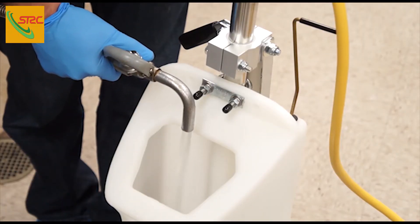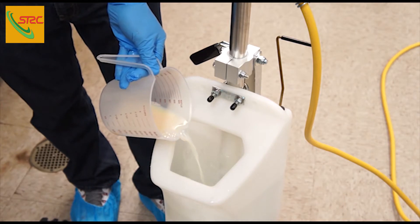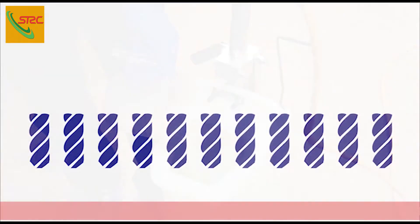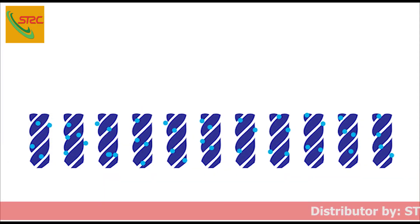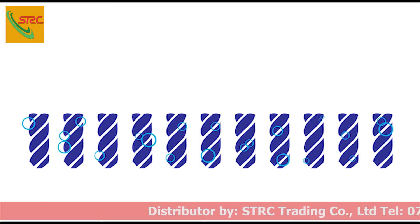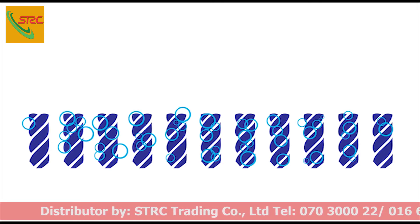Now you are ready to prepare the shampoo solution. Begin by properly mixing the cleaning solution according to the product label directions. It is important to note that improper dilution can leave excessive residue on the carpet fibers, greatly increasing the likelihood of re-soiling. Excessive foaming will also occur, which can extend carpet dry time and labor.